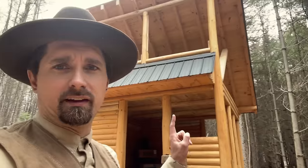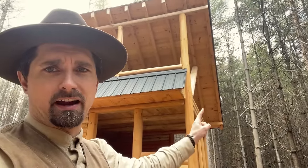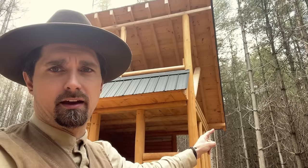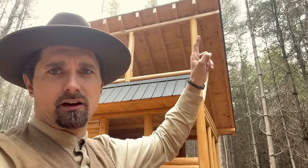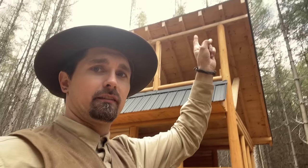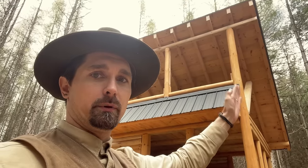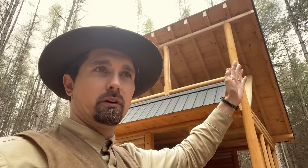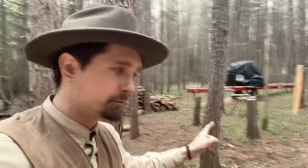I'm not sure if this is going to make any sense, but if you look here, this rafter is centered to that beam there, that wall. When it runs up here, it's off a little bit. I don't exactly know why this happened, but in order to true it up so that my walls are flat, I've got to make myself a spacer that gets from 4 inches thick down to 2 inches thick and builds up that rafter on the inside so that I can build my wall. Fortunately, I've got a mill and I can cut myself the exact piece.